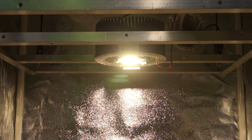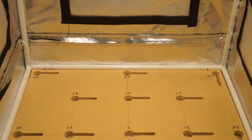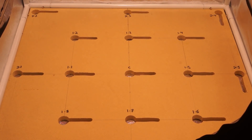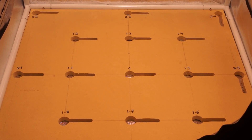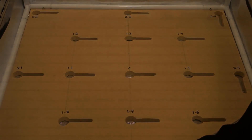These six diodes have quite an effect on the color temperature of the light of a white COB. I rigged up a 3500K Cree CXB3590 with an Anthelion in a 2x2 tent just to see how much it changed the color of the light. On my test light the COB was running at just 700mA — a pretty low current — so the red of the Anthelion really came through. The Anthelion was running at 1000mA and it was clear when it was on versus when it was just the COB alone.